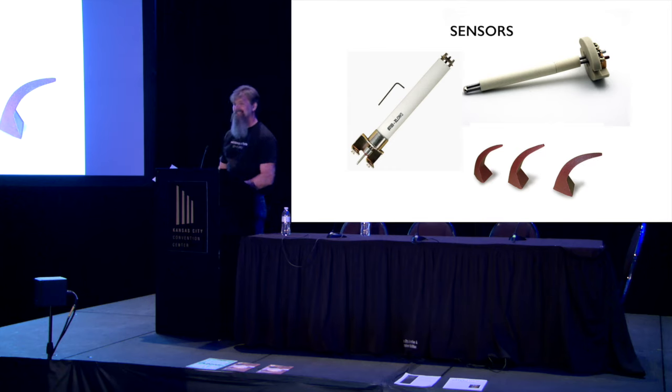On the upper side there, that's a type K thermocouple. Thermocouples run on something called the Seebeck effect. We have two dissimilar metals. One's magnetic, one's not. They're welded together at the end, and when they get hot, it creates its own little microvolt. As it gets hotter, the speed that goes through, or the current, changes. And the computer can say, hey, that's faster, move the needle. That must be going up. And that's a known effect, and it's a known rate. So that's how thermocouples work.